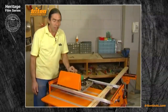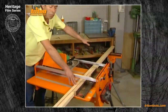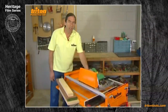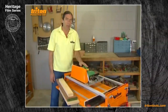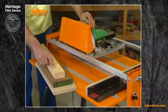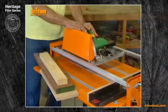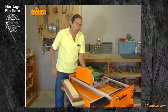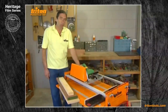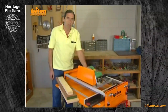Always consider your offcut — if you're cutting a long heavy piece, don't just leave it hanging in the breeze, because as you cut through it will drop. Have it supported, preferably on a Triton multi-stand. The feed rate — the speed at which you push the saw — is just as important in crosscut mode as in table saw mode, and depends on the density of the material, the power of your saw, and the quality and sharpness of your blade. Trial and error is recommended. Don't overload the saw by pushing too fast, and don't push too slowly and burnish the end of the wood. Never force a dull blade — get it sharpened or replace it — and never jerk the spinning saw blade into the wood; feed it in gently.